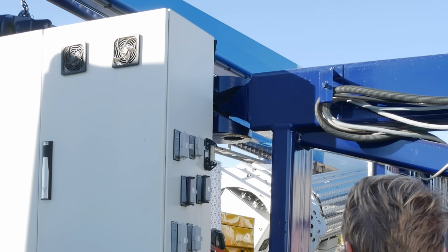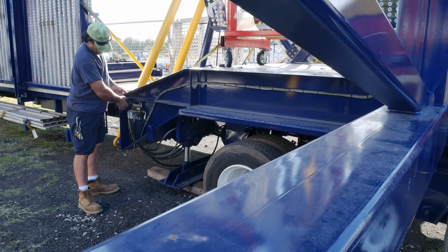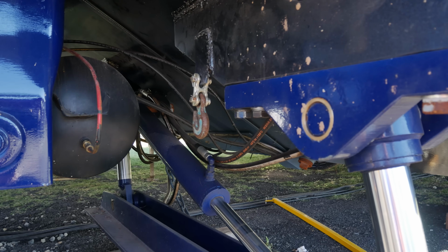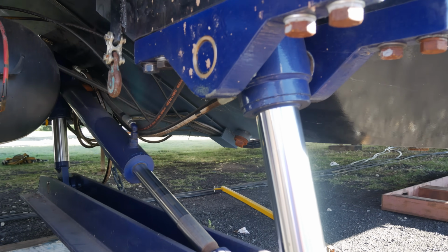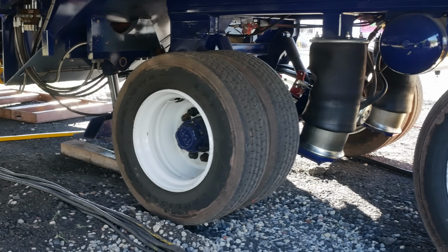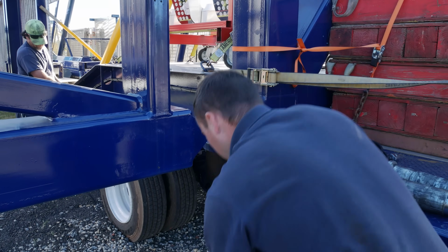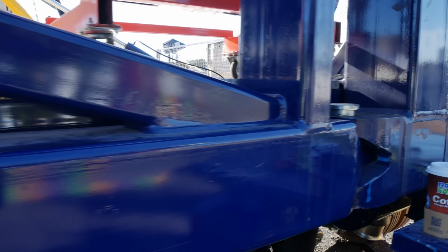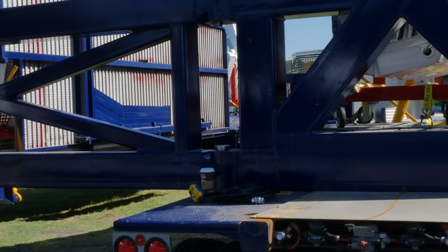The rear trailer has what I can best describe as gates that swing out and align with notches in the front trailer. The front trailer has a pair of hydraulic-controlled feet that basically allow you to walk it into position. Once everything's lined up, large pins are inserted, and that holds everything in place.